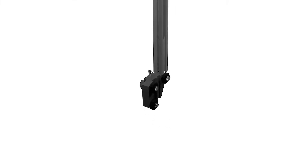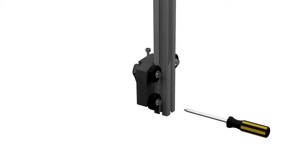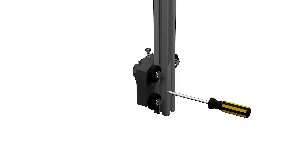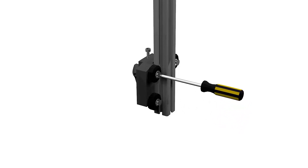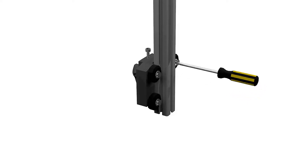Slide the carriage through the 1 meter aluminium extrusion and tighten the bolts until the carriage has a firm grip but is also removable. If the wheel bolts are tightened too far, the motor will overheat and cause layer shift. If they are too loose, they will jitter between each movement during the print, causing a shaky and slanted print.